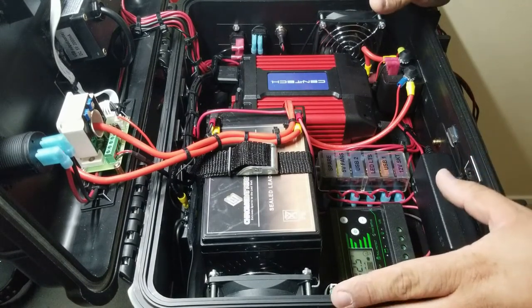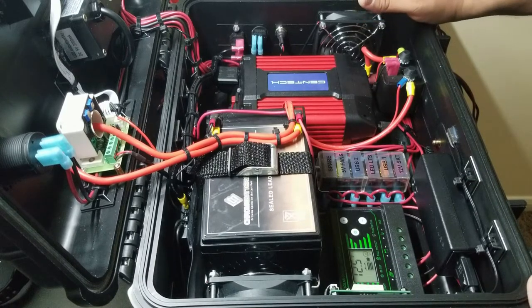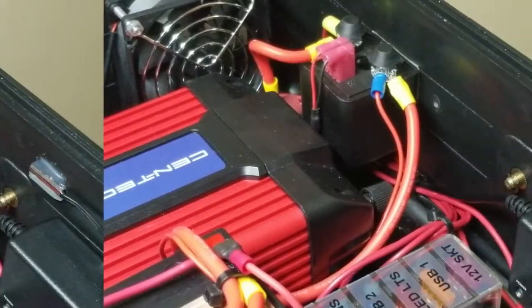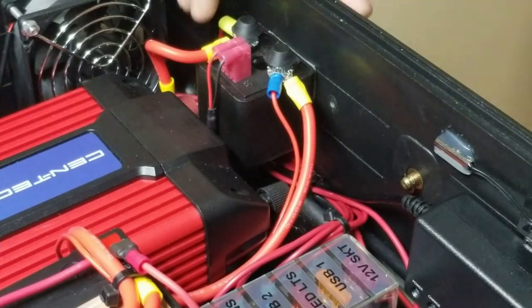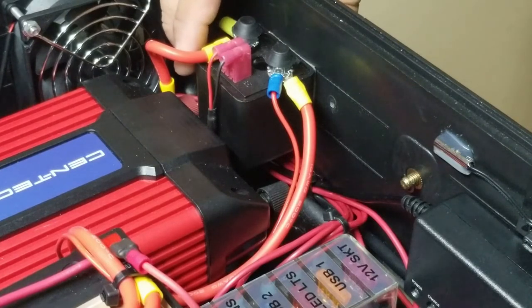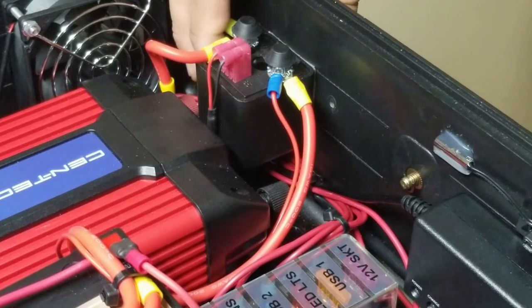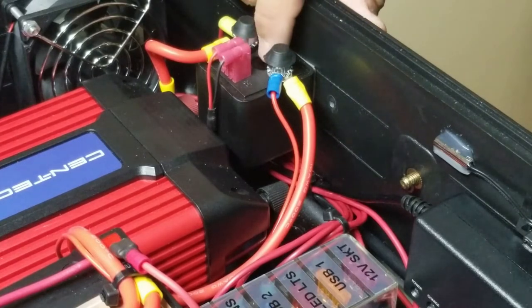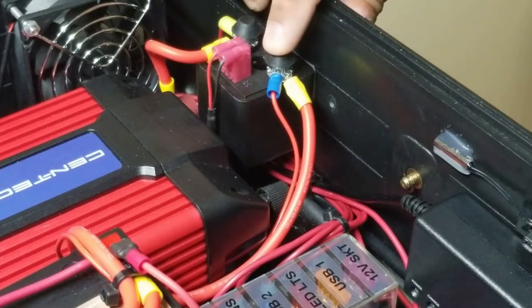The wiring is complete. And now we're going to go ahead and get a close-up of some of the components that I haven't talked about yet. The next component we're going to look at is this 12-volt, 100-amp automotive relay. I'll post a link in the description below. This one was not factored into the cost of building it. Initially, I was going to go with a breaker, and I had already installed it. But I decided to go ahead and use a relay, so that way I don't have to open the box anytime I want to energize it. I can just go ahead and use a button on the Drok multimeter.